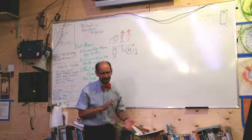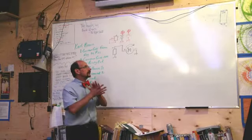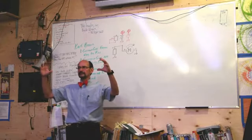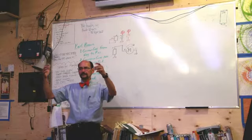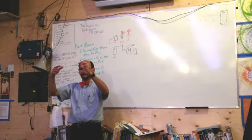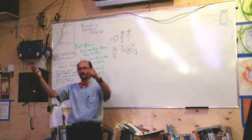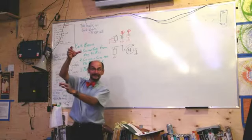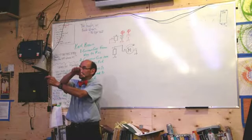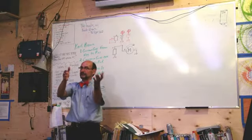A couple of things about this very simple diagram. These motors — I won't go into the whole description — but vaguely, here's how it works. You've got two magnets, a north and a south, and you have the rotating part called the armature with wire wound around it. We put current through that wire and it creates a magnetic field which opposes the north and south and tries to get away. If we did just that, it would go clunk, rotate one half, and stop — because it's now happy.